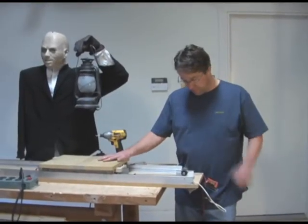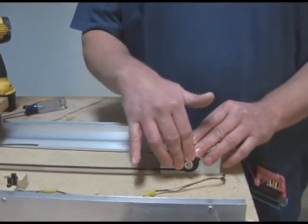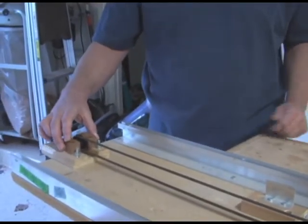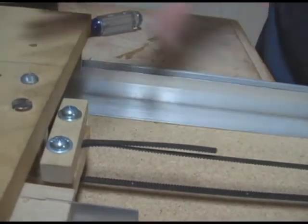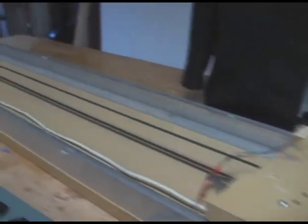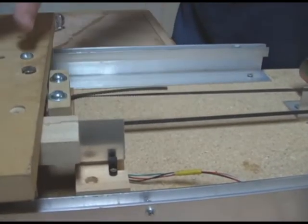To make the base move I'm using a 12 volt gear motor and a timing belt — a quarter inch wide rubber belt with teeth. On the motor I've got a timing pulley attached to the shaft, and this belt goes all the way down to the other end where a matching ribbed timing pulley is attached, except this one isn't on a motor shaft — it just has a quarter inch bolt going through it. The belt is not a continuous loop; it wraps around and both ends of the belt are attached to the base.